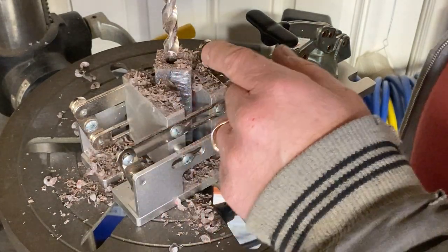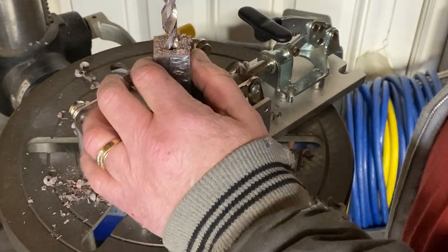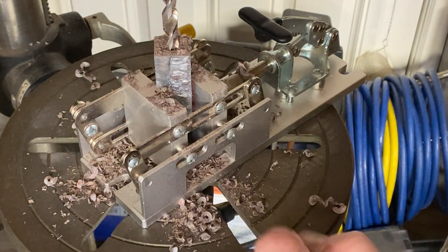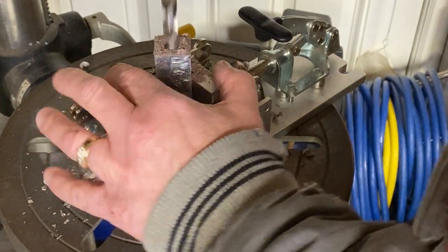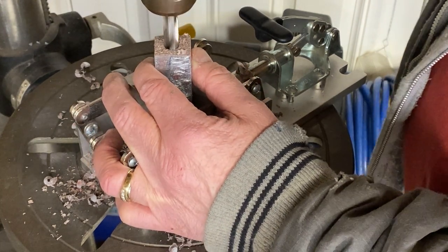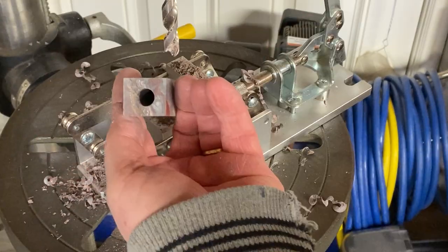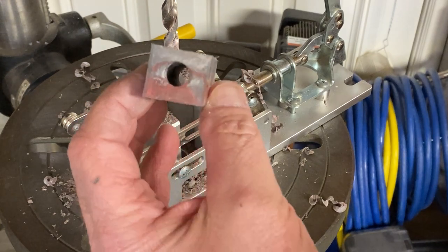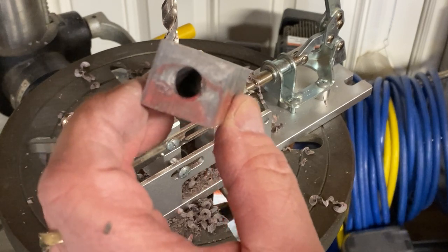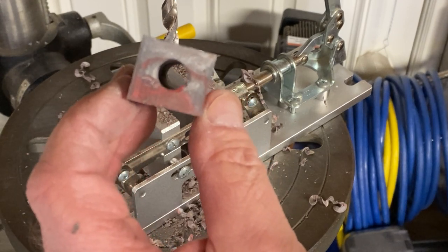I had to stop because I ran out of travel on my drill bit, so I'm going to raise the blank onto the bit. We're going to lock it back in place and now we'll see if we have enough travel to complete the hole through the blank. We just pulled through the bottom. I've got a nice hole right down the center of the blank and you can see ever so slightly just a tiny bit of chip out on the edge of the blank, which is perfect because we left it super long. That's going to disappear when we cut the excess off of the blank.